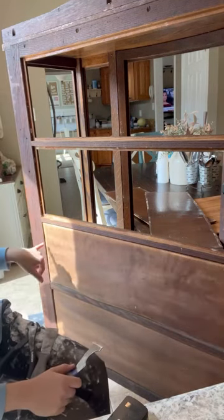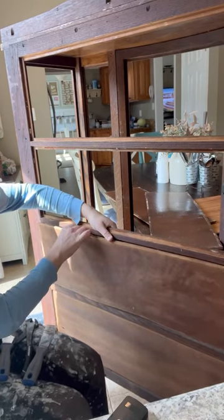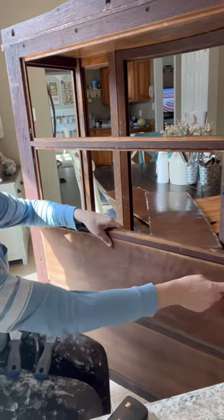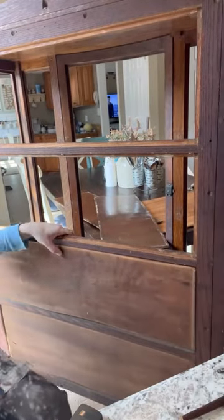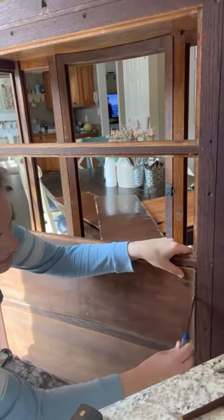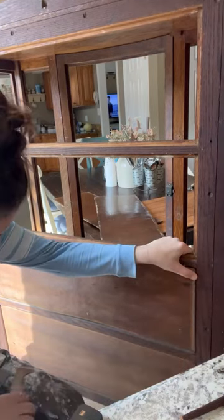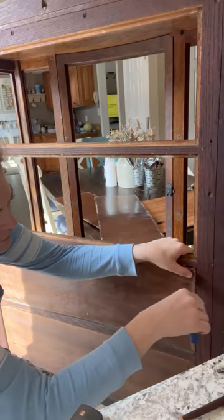I did the top and the side here. I don't want to damage this wood. I'm going to start with my 5-in-1 because I have a pretty good gap here. If it was really super tight, I would have taken my putty knife to get in there and just pull from the frame a little bit.